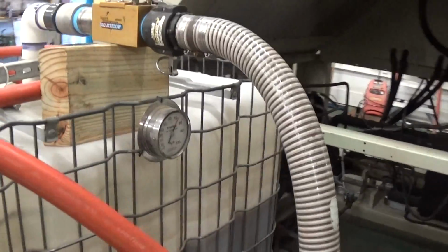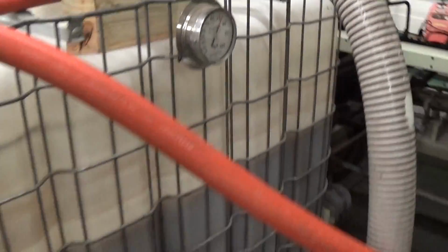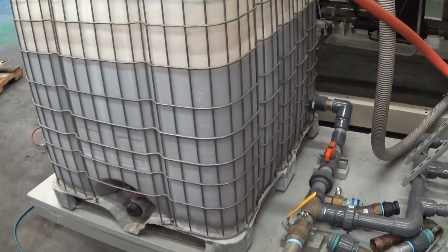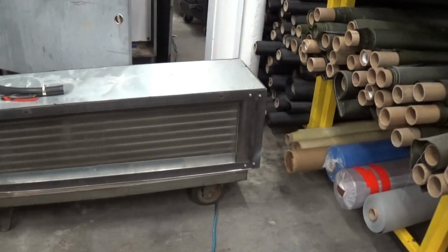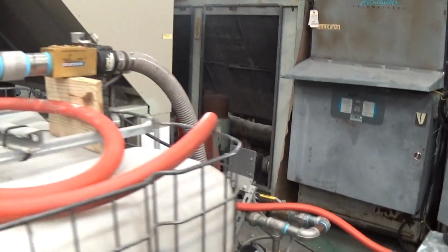In this case, this is our pump tank system, kind of homemade, but we use it for testing. We have the tank just up to about 72 or so. There's probably 200 gallons or 170 gallons of a glycol mix in here. And we'll probably chill this down to about 45F today. And then just to give us a little bit of load, we have this air handler here. It's actually getting hot here in Massachusetts today, and that'll give us a little bit of load once we start.